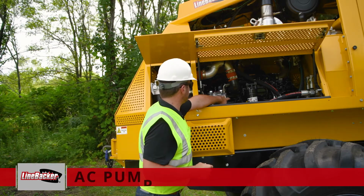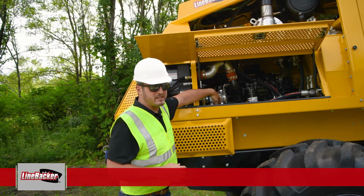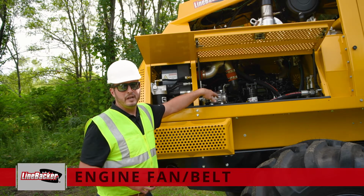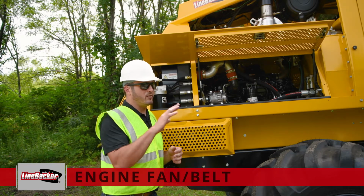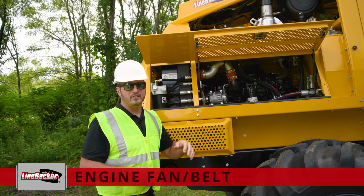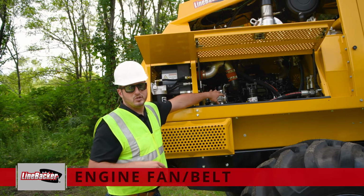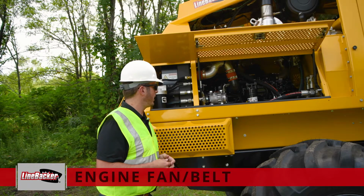We can see that we have our AC pump and our fans and belt area there. So with the engine off, you can inspect the belts, inspect that area for debris. The engine is equipped with an automatic reversing fan that's actuating fan direction every 15 minutes. So debris can build up on either side of that engine's radiator. Just be sure you are taking a second at the end of every day to, again, with the engine off, double check and be sure that no debris is lodged in there. It's also a good time to check your belts for cracks or any type of wear of that kind.